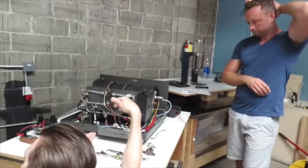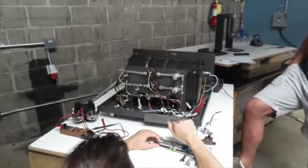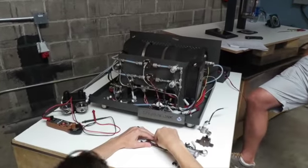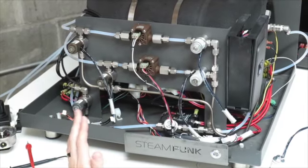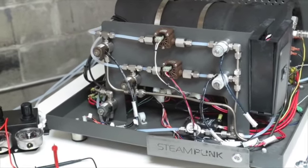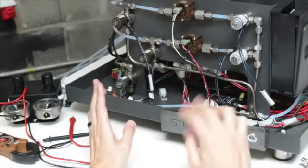So, to get more into depth on the 24 volt system now. Out of the backside, depending on if you're talking to someone who does computer design, they call it a ground, but really it's the DC negative and positive. Some people will call the negative a ground, so as fair warning, if someone's referencing a DC ground, they're talking about the V negative. So there's V positive and the negative.